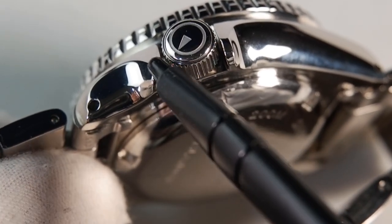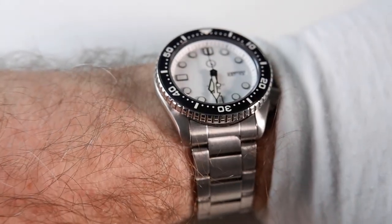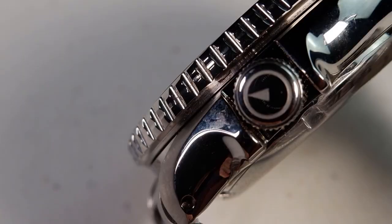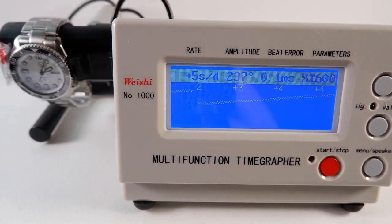LIW smoothed a sharp point in the case, which is a huge improvement — now you can wind the watch without grating your finger. The first batch had anti-reflective coating overkill, and along with excessive edge distortion from the crystal, made the original batch challenging to read. The Panda crystal is now super clear with only minimal edge distortion, making it a very readable watch. The crown is now signed. Before cannibalizing the Panda, I tested it on my time grapher: it's running four seconds fast per day in the horizontal position and five seconds fast in the vertical position — very accurate compared to my first two LIW watches, which while within spec, were not very accurate.